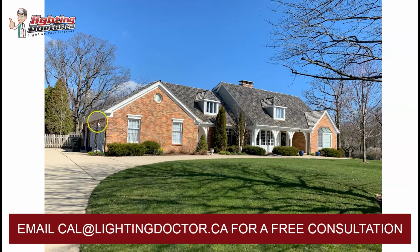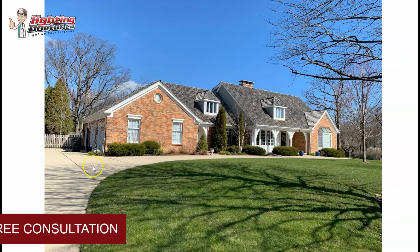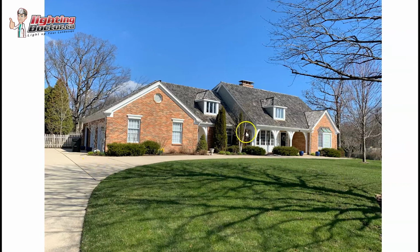And then just to round out the look of the landscape around here, and because you have this tree lit up here, it would be nice symmetry across the whole front. I would probably try and get an accent light on this guy and on this guy on the end. The only thing I would do is, instead of putting it right in front, I would put it more to the side. And what that does is it extends your viewing angle. Not that you're not going to get the effect of it looking in the front, but you've got the whole front of the house lit up really nice. And then if you're more at this angle, that tree stands out a little bit more. Same thing if you're more to the side of the yard, that tree stands out a little bit more from that side. So really, you're just rounding out your entire viewing angle.